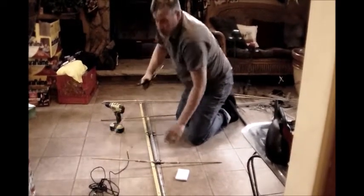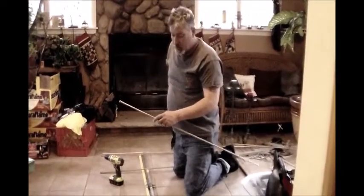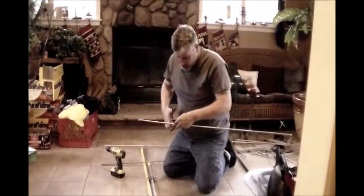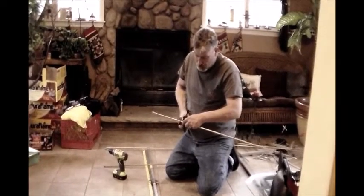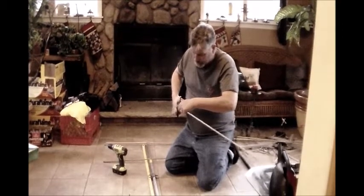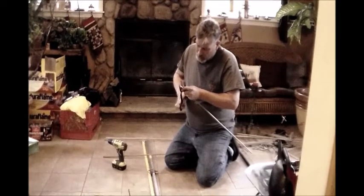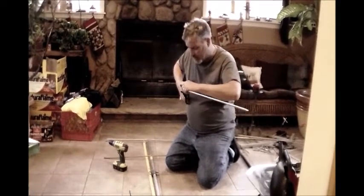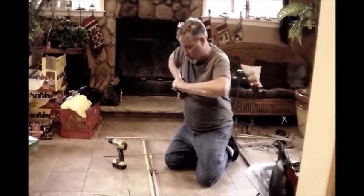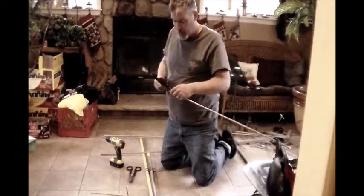This really worked out perfectly with this material. I had very little cutting to do, and I could do it all just with a pair of snips. So you can see I mounted these elements already. I simply took it, measured the element to size, lifted it off, then just to neaten it up a bit, I snipped off a little on either side and crimped it down with a pair of lineman pliers.